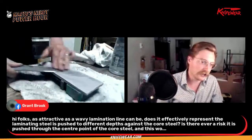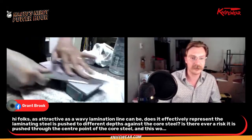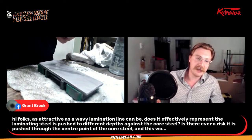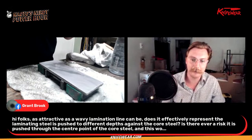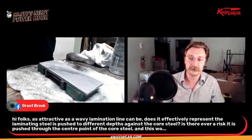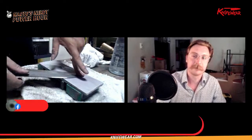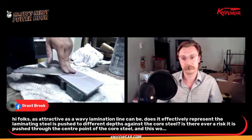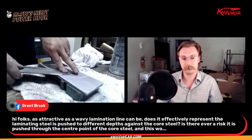Grant Brooke has a good question from Facebook. Says, "Hi folks, as attractive as a wavy lamination line can be, does it effectively represent the laminating steel being pushed to different depths against the core steel? Is there ever a risk that it is punching through the center of the core steel, and this would then be exposed at the cutting edge when sharpening or thinning? How thick is core steel typically?" It's a good question. So the wavy lamination lines can effectively represent the laminating steel at different depths.